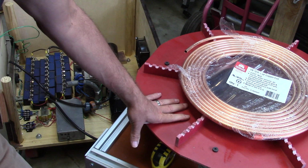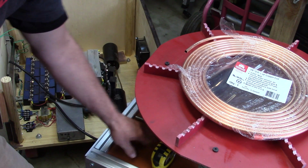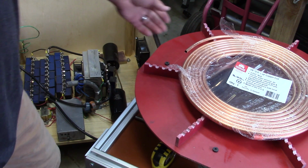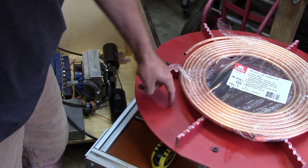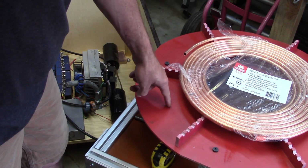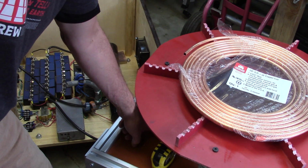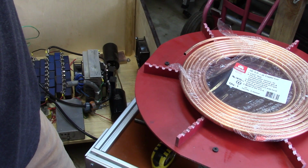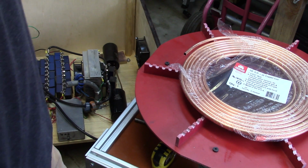Will that joint be up here, outside? Nah, for looks' sake, it really should be underneath the surface here. It should be inside. So I'm going to have to run this coil. I'll have to drill a hole, and run the coil of tubing down through this and then down through this layer here to appear inside. Problem is, when I try to sweat it, it's going to be inside, and this is PVC, and I don't want to start the PVC on fire.